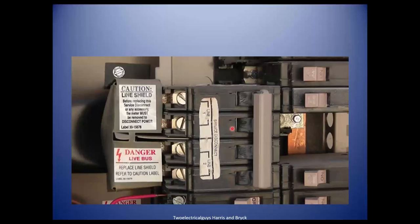What am I staring at here? It looks like a 200-amp breaker broken down into four 100-amp breakers — two 100s in parallel and two 100s in parallel, making a 200-amp service. It says right here: service disconnect, line one, line two. Why four instead of one big breaker? Number one, it's cheap to manufacture; number two, it fits into a smaller space. There's nothing wrong with this — counting them up, it's still a 200-amp service.